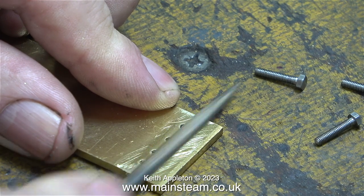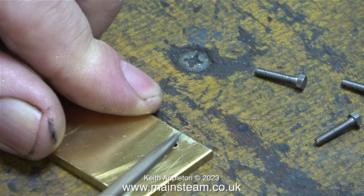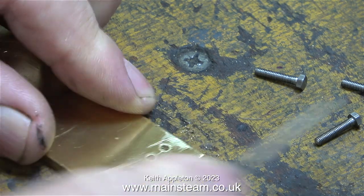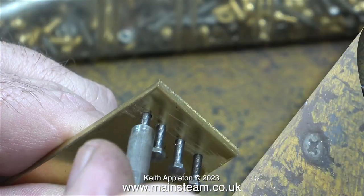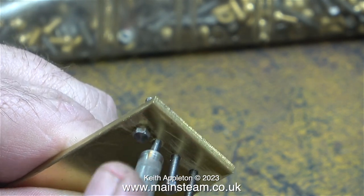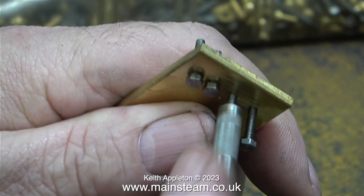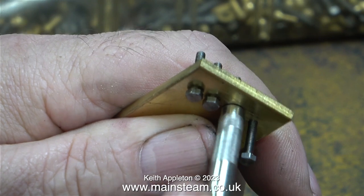What is important though is the deburring process — I'm deburring both sides. The next part of the job is to screw four 7BA hexagon bolts into these holes, making sure they go all the way in. I'm using a nut spinner for this; they don't need to be very tight, just tight enough to resist the next part of the operation.